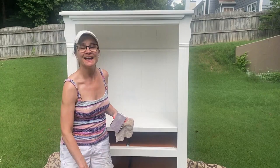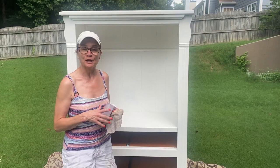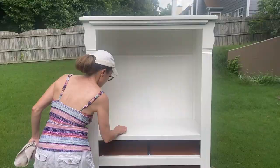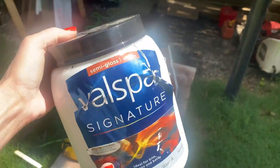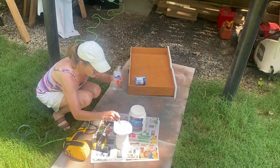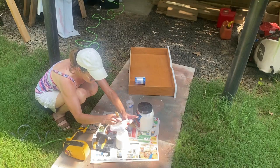It's finally paint day and I feel like I'm gambling because in the Atlanta area we've had really weird weather — the sun will be out and then we'll have a rain shower — but I just have to bite the bullet and go. Before I paint I do need to lightly sand down any imperfections in the primer, any little bugs or anything that may have landed in it before it dried. I'll lightly sand that down, wipe it off with a damp rag, and then I'll be ready to paint. I found some leftover paint from a previous project — a semi-gloss white. It was very thick so I added a lot of water. I need it thin enough to come out the sprayer, and I'm adding the water as the paint goes through the filter. You need to filter your paint before spraying so there aren't any little pieces that block the nozzle.